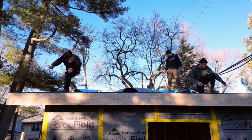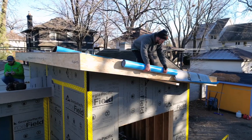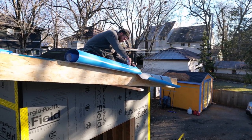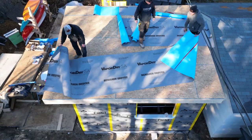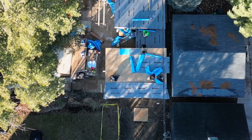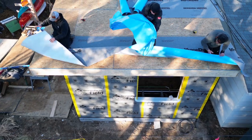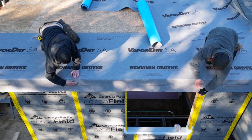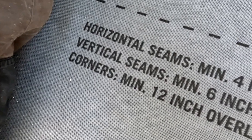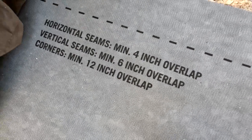The first step in the installation process is snapping a line to position the top of the first row. Enough sections of Vapor-Dry are then cut to length. David's using a handy little jig, which is basically a 2x4 screwed into the underside of the rafters. This ensures the piece will be long enough to fold over the sub-fascia on both ends, sealing those edges as extra protection from air and water leaks. The strip is positioned onto the line and the top release sheet is peeled off. Horizontal seams overlap at least 4 inches and vertical ones overlap at least 6 inches — but don't worry about memorizing that because it's printed on the membrane.